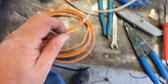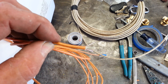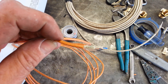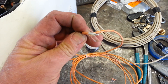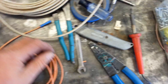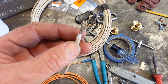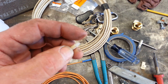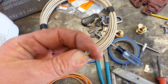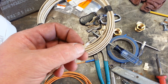I was going to show you this wire that I used. You can see the 200 centigrade rating on it — it's a nickel wire, not a copper conductor. That is only a number 16 but in the book that thing's good for 35 amps. Here's a little bit larger one I use for heating elements in industrial buildings — same temperature rating, 200 degrees centigrade, pure nickel wire. That is not copper clad with nickel; that is pure nickel, and it's got the 200 degree jacket on it.